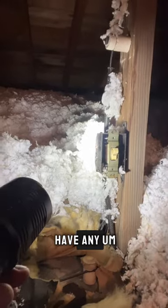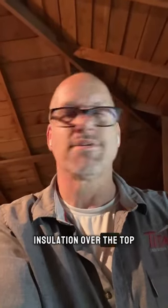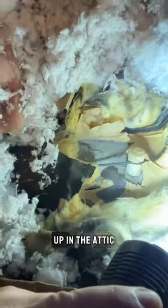Obviously, we don't have any cover on there and you can see some insulation blown in there. Knob and tube isn't necessarily unsafe if they haven't blown insulation over the top of it per se. We're talking about it has the hot and neutral wire and not the ground wire. But the key is they want to cover it up in the attic, and that's what we're seeing here. I would recommend that they have an electrician come out here and take a look at it.